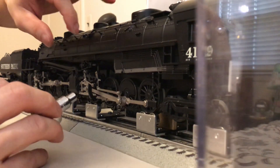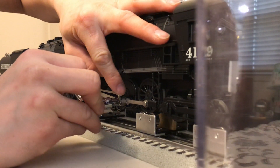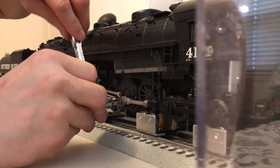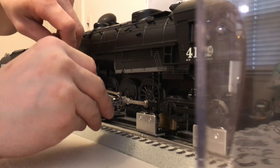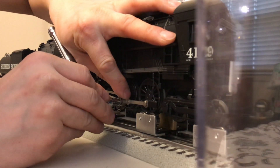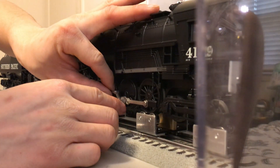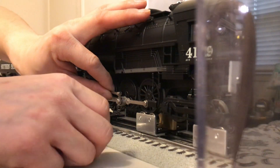Our wrench is set properly now — let's see if I can get in here and do this correctly, because this part is always a pain. If I don't hold the eccentric rod and crank, you can see that as I'm moving the locking pin, the eccentric rod and crank moves with it, because it is not locked via the teeth. That's what I didn't want — let's come out a little bit. All right, there we go, that's where I want you to be.